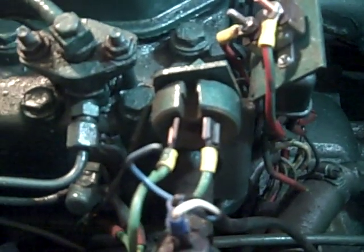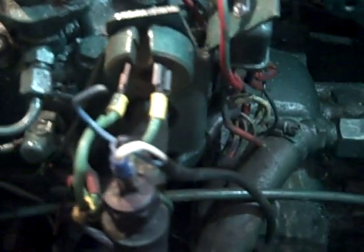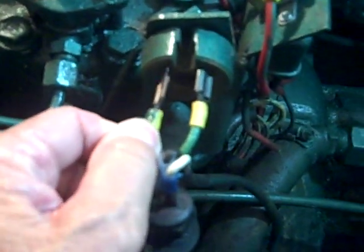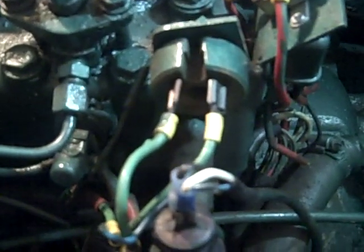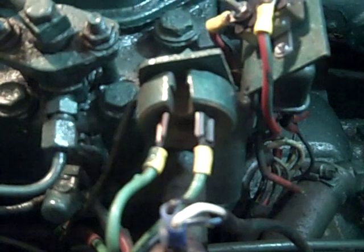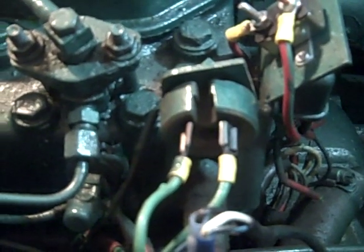There's another Volvo device next to it that we haven't figured out how to get rid of. These connectors just slide on — they're terrible because they carry a lot of current and you have to maintain them. If those connections don't get power, corrosion sets in and your preheaters for your injectors are not going to be preheated.